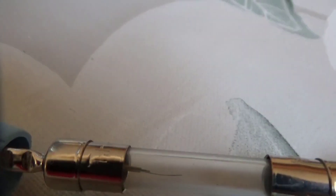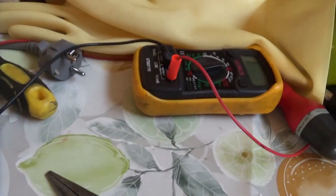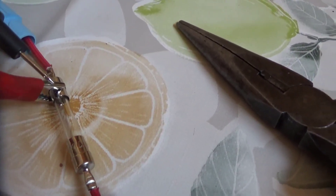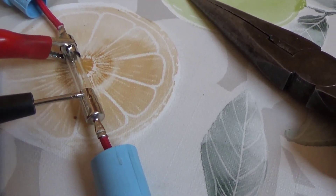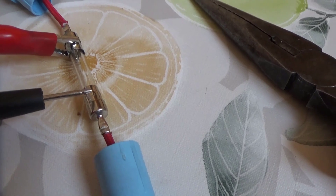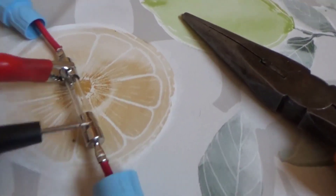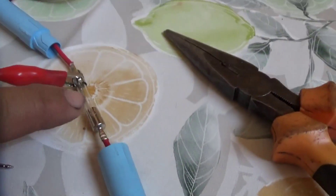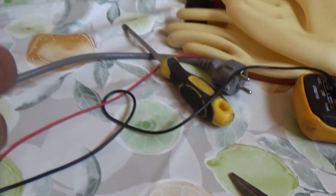Yes, I see it now — it's all broken. Do you see it? There it is, very broken. Now we check it with the continuity test. Let's check here to make sure the multimeter works — if I touch it, it should beep. Now I go to the other end of the fuse: if the fuse beeps it's good, if it doesn't, the fuse isn't good. I touch it and the fuse doesn't beep. Even though you can physically see that the cable is broken, it doesn't work. Now I have to take the fuse out of the fuse holder, replace it, reconnect it and that's it.